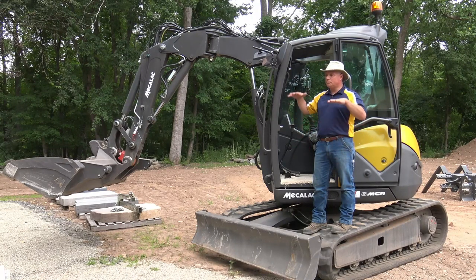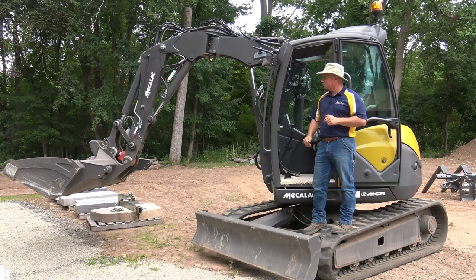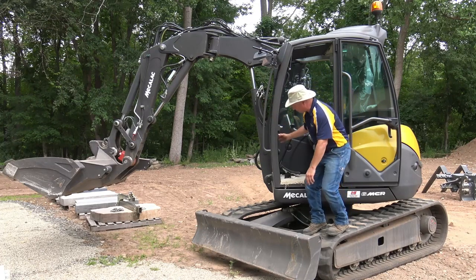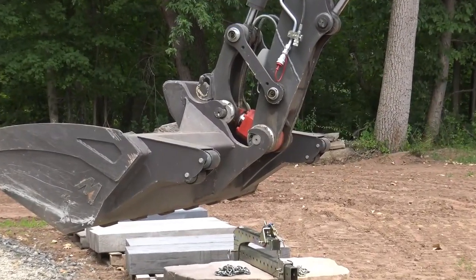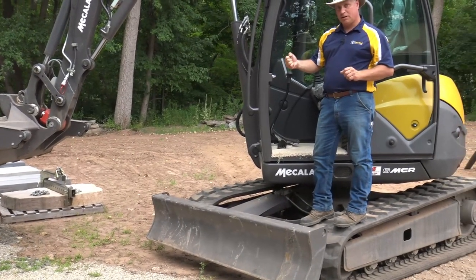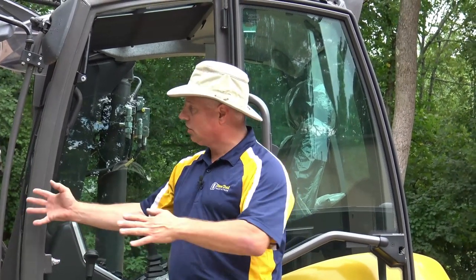Forks can couple to this machine, and the unique thing is I can literally set a pallet over six feet below my track level. So if I'm doing a retaining wall and I'm up on a bank, as long as I'm stable, I can reach the pallet down below me. Just a switch or two in the cab and that bucket comes into these spots — you can see the rollers on the bucket — and I can switch it in the cab to CAT controls or skid steer CAT controls. On my right hand I'd run my bucket loader with up/down and curl/uncurl, and my left side becomes my travel.